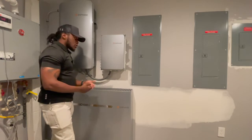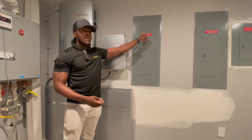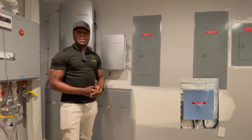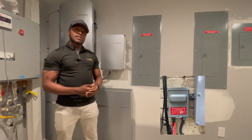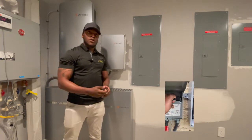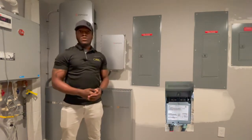Now to find these boxes, you'll see a gray conduit running from the side of the home. You'll normally have this red warning label on them just to help you locate them. If they don't look like one of these giant Enphase boxes, you'll see a small square box with about eight screws on it. It'll also have an AC disconnect to the left or to the right of it, just a few inches away. You'll also see how we turn on and off that part of the system, and they'll also have this red warning label on them.